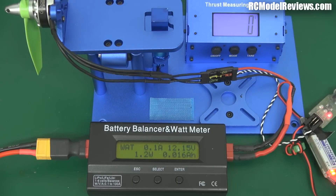That was very interesting — down to 2.9 amps for the hover current. That's a lot more efficiency. When I flew these props I did get an extended flight time flying around gently — I was quite surprised, it went up by about a minute, which is quite a bit. We're drawing much less power at hover power. Now let's wind this up and see what we get in terms of maximum power and maximum current draw.